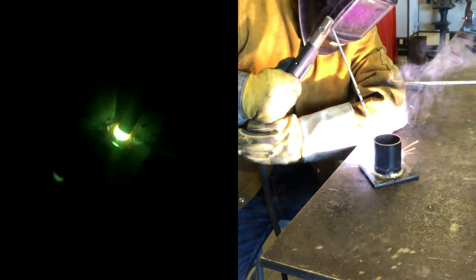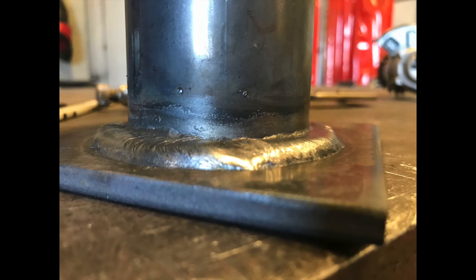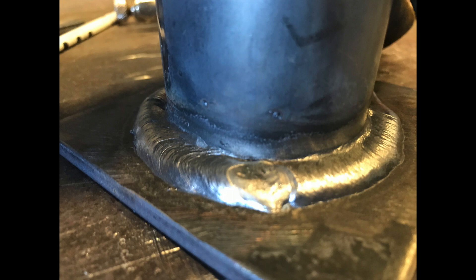At this point I went ahead and welded the whole second pass. Remember, you want to try to cover up that first root pass by at least 80 to 90 percent. Really follow that pipe — don't worry about what the root pass is doing, watch the gap between the top edge of your weld and the pipe, because that's where it all counts. Just like the first pass, I did it in three beads with the same tie-in method. I left myself a nice shelf for the third pass to sit on. I also ended up using the bent rod technique more, which gave me a flatter weld especially on the top pass.